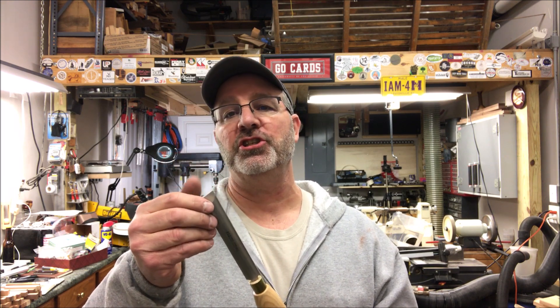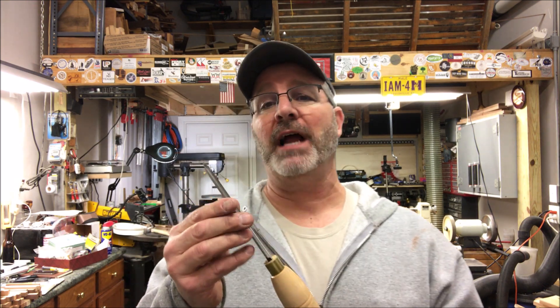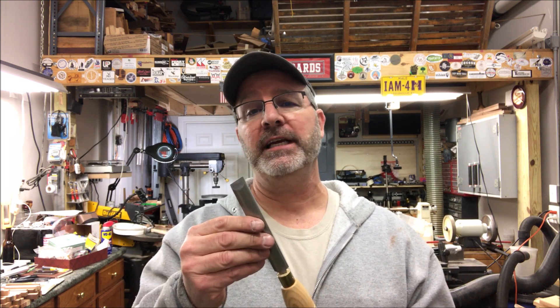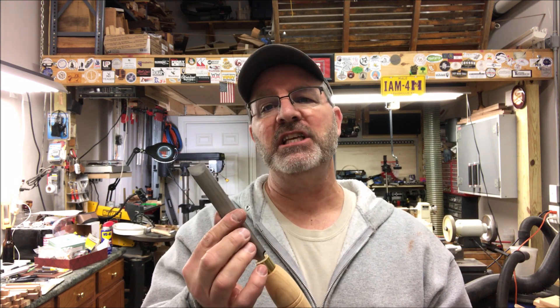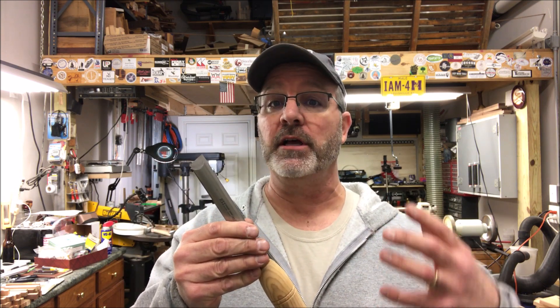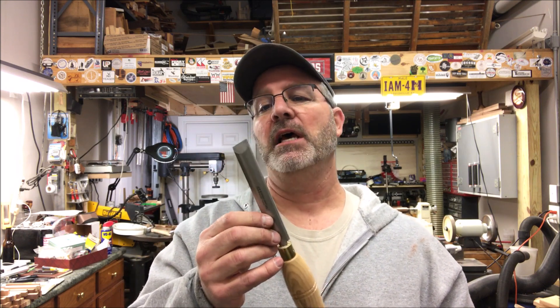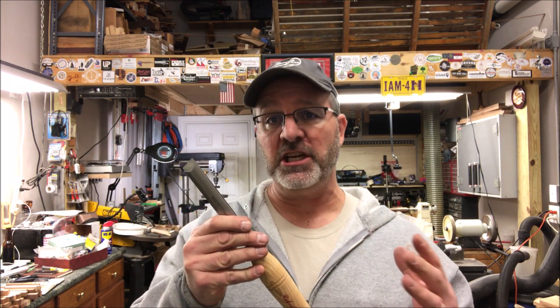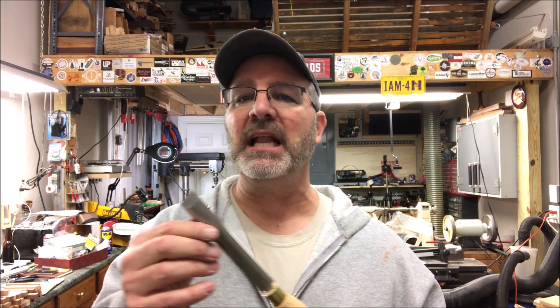I just want to make a comment — this is not something that you need to do on a very regular basis. Pretty much once you get an edge on your skew and get it nice and sharp, you generally just need to strop it. I'll strop before I start turning, and generally after I get the blank round I'll go back and strop again. If the blank is giving me any resistance, or it's a very hard wood or hard material, I may strop a couple of times during the turning process. And if I'm getting close to finishing a pin and want to take it right down to the bushings, a lot of times I'll run it over the strop just to make that last finishing pass.